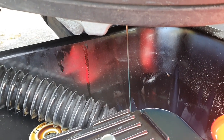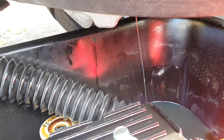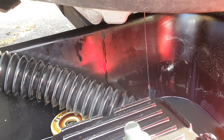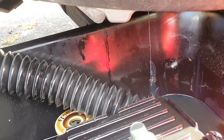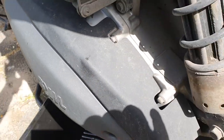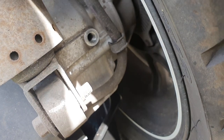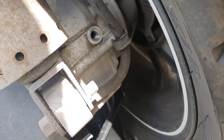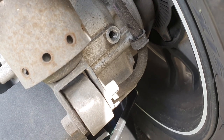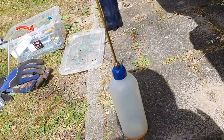It's a very very thick, very dense oil and it takes its time to get out and also to get in. While we wait, let's talk about how to refill this thing, because the hole used to refill the oil is almost parallel to the ground. You need something to force the oil in, which is why I use this concoction: an oil bottle that I insert inside the hole and keep upside down. The problem is that the bottle goes vacuum, so it takes hours before the oil flows in.